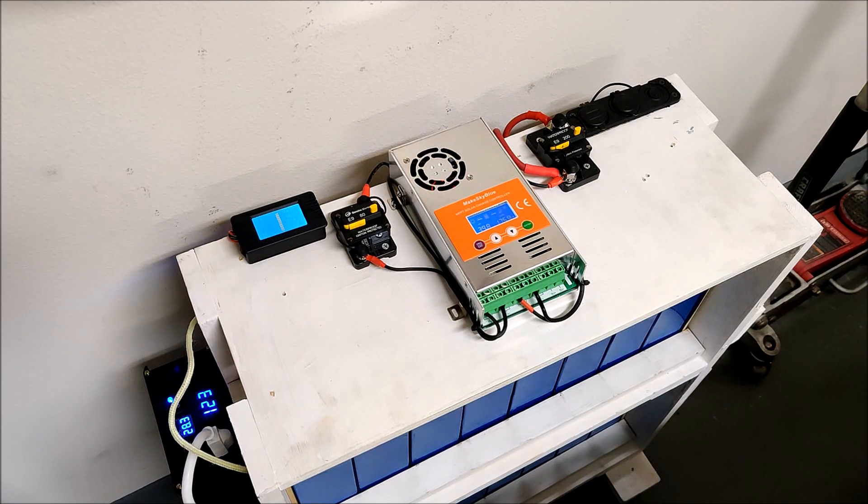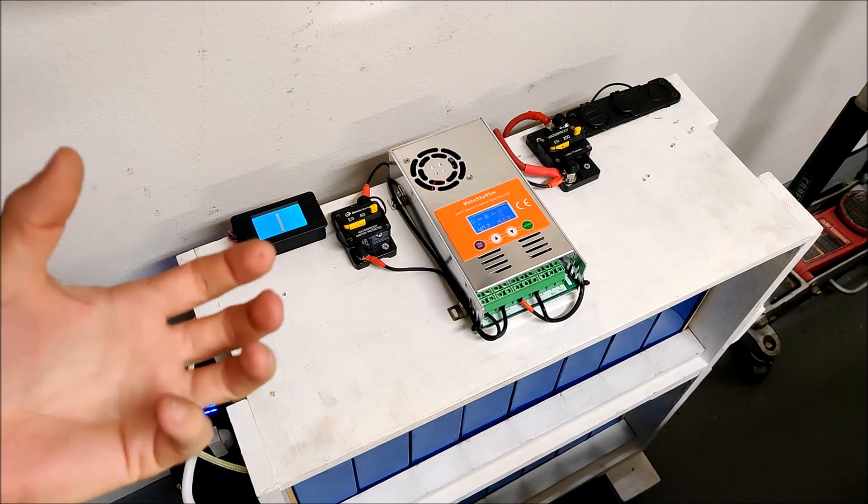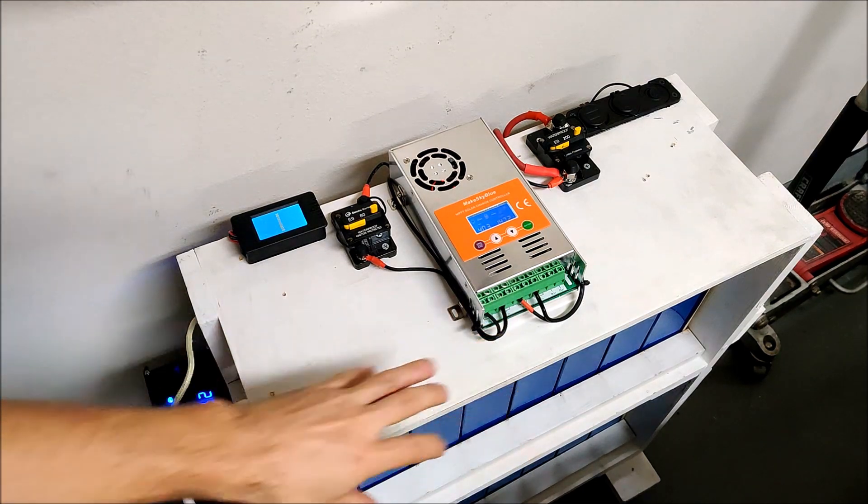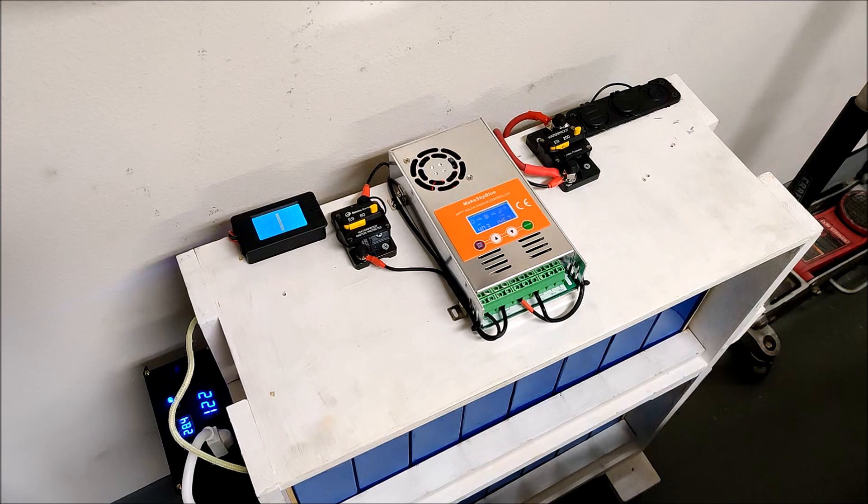Solar is pretty cool. If you're ever messing with batteries and trying to recharge them, you'll quickly figure out that charging batteries with anything more than a 100 or 200-watt power brick is actually pretty difficult. Most power bricks you get to charge batteries are less than 100 watts, and when you start charging really large batteries it becomes quite difficult. Even a nice big ISDT T8 charger is max-rated for 500 watts.